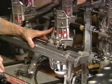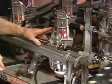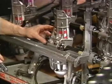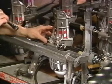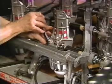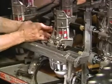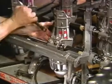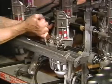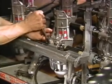The last adjustments that would be made would be putting the individual pins on spot. This can be done with the spotting cup itself. With the table positioned so that the base of the pin is just slightly above the spot, we can see where the pins are going to be placed, and we can adjust this cup to put the pin in the proper place. That is, if we were to loosen the top bolts that we see here, and then in turn tighten the bottom, we would pull the pin back on spot. Reversing that, loosening the bottom bolts and tightening the top, would pull the pins forward on spot.